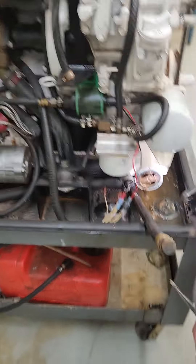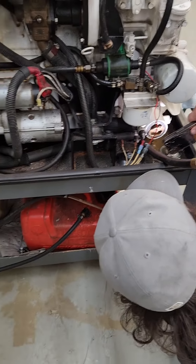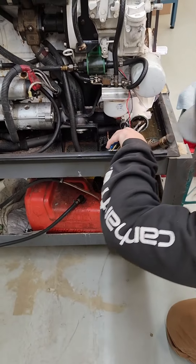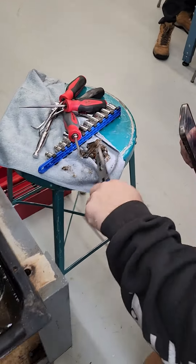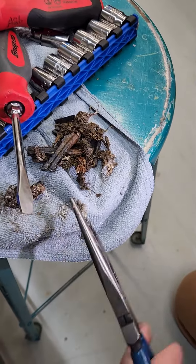Back flush it when you're done — probably makes a little bit of a mess, but that would clean the rest of the tubes out. He's got it about 90% empty, but that was pretty close to probably a full blockage of the end of that heat exchanger for sure.